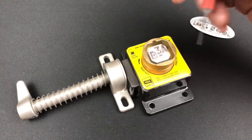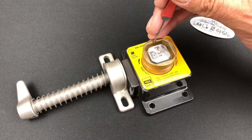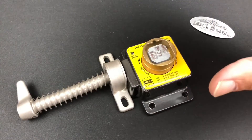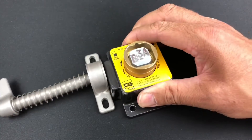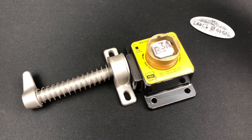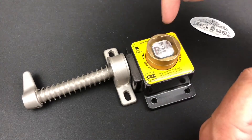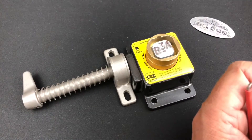The unique key would actually have the negative side on top with a little semicircle notch in it. The system comes in two parts: you'd have the power supply unit for the particular production plant, and this unit would be on the gate or door to the actual production line. You'd put the key into the power supply unit and turn it on, which should then energize the power supply.